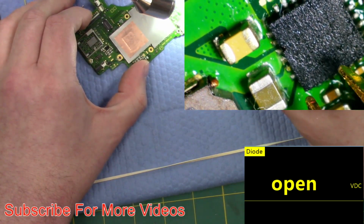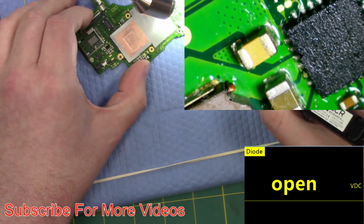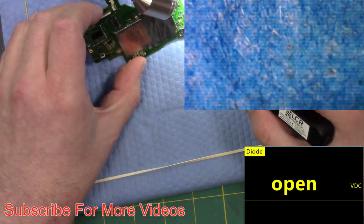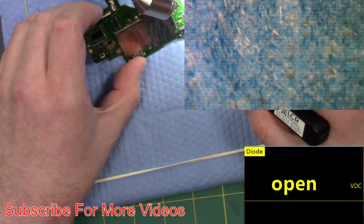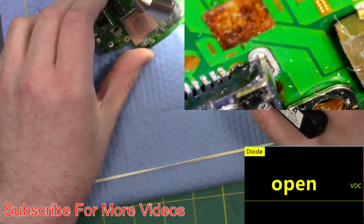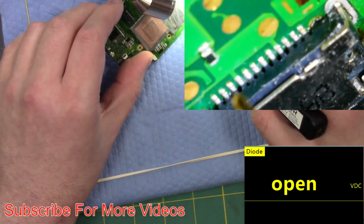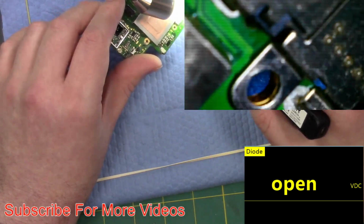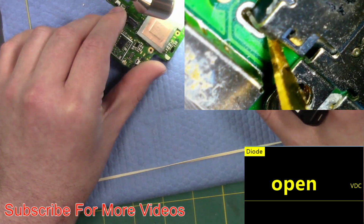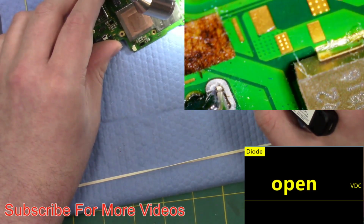Now, I believe that this chip and the USB port were replaced correctly, because I plugged in a USB lead and I checked continuity based on the pins I know to these pins here, and it appears to be soldered well. A little bit more solder could go into the back here. I'll touch that up if I get this working. There's a lot of things I'm going to do to this if I get it working.